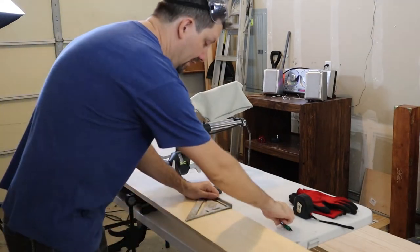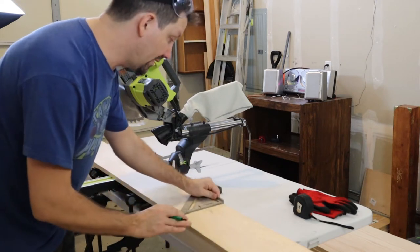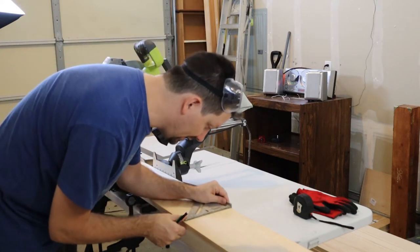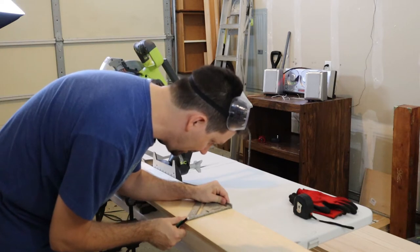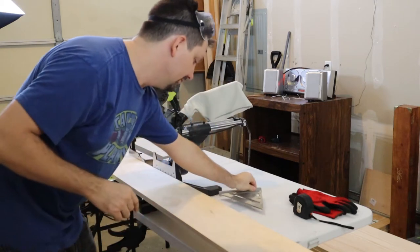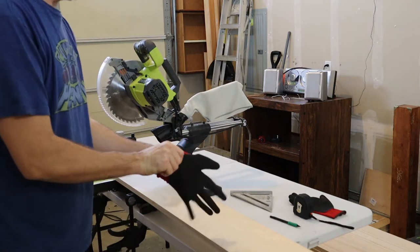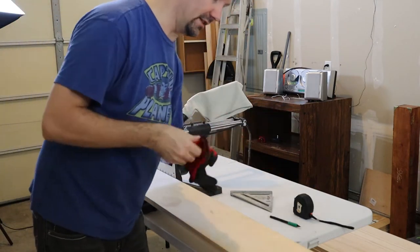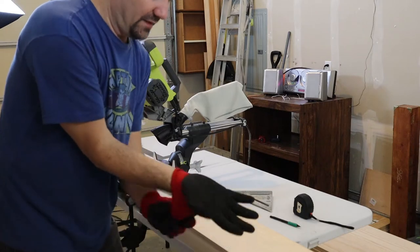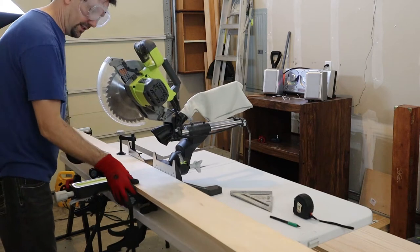The first part here is measuring the top board for the top part of the cabinet shelves — 72 and 3/16 of an inch. I've already done that line up there, just scoring it off here to make sure we're nice and exact. Now we'll go ahead and make a cut. We'll always be doing some protection. This helps against slivers and things like that because these boards, while they're finished and treated, still have some rough edges. And again, always, goggles are good.